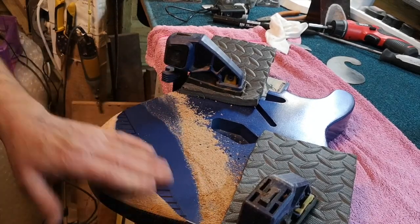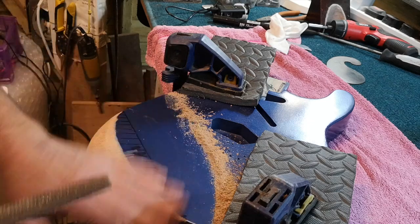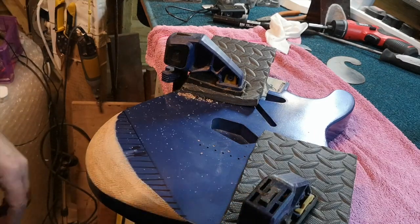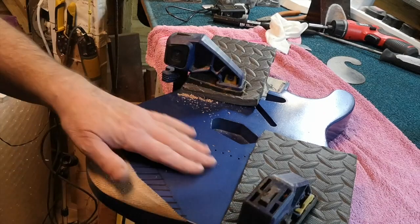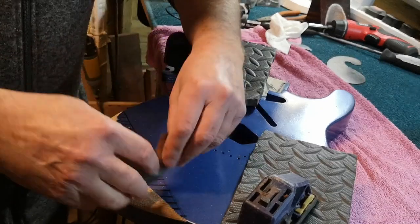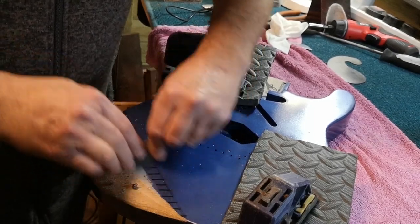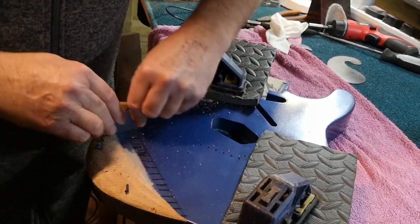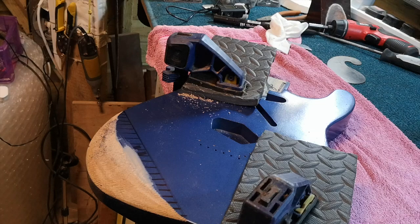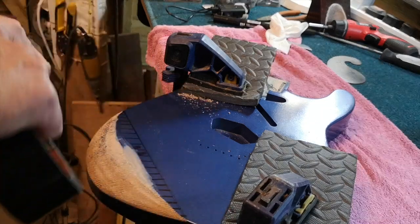And then as you come up towards this line, the danger is it's very, very difficult not to put down the edge of the file. And it's very easy to tip the edge forward if you're trying to get to the line. That's why if you get close, one of these things can be quite a good way onwards from there, because you can track a little bit more easily where you are and kind of wear it down to the line. But the other thing you can do, if you feel like it, and if you know that the finish is strong enough, is protect it.